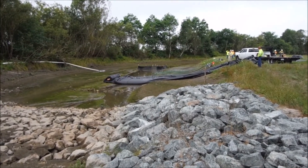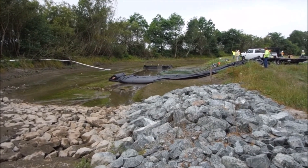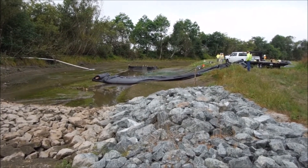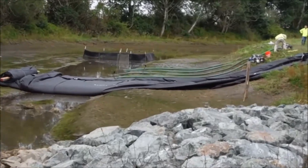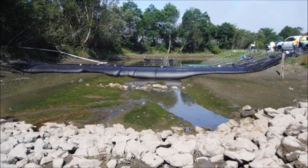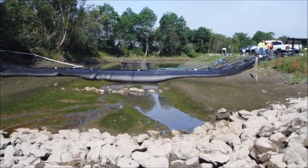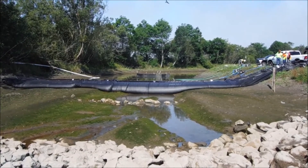We've been filling the 8-foot tall aqua dam for about twenty minutes from the water storage aqua dam on top of the bank. We've prepared the four 3-inch pumps on the side of the bank to suck water when the tide comes in — and it's coming in. Now we just have to wait for the tide so we can start pumping on our 3-inch pumps. The aqua dam continues to unroll up the bank — maybe another ten lineal feet remaining. The four 3-inch pumps are pumping the aqua dam up faster than the tide height is increasing on the other side of the dam.